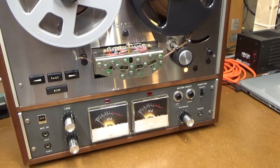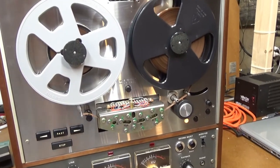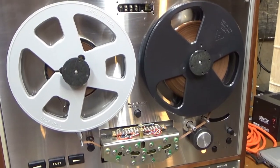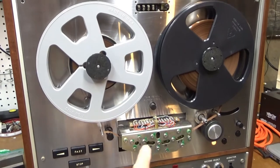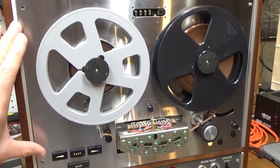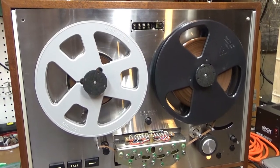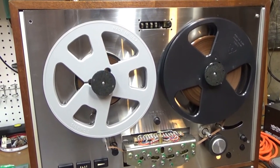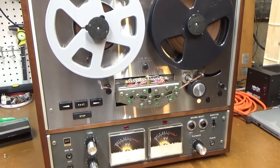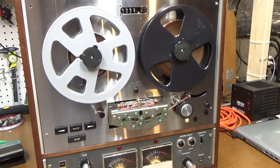Another issue is on playback — the audio off the tape was very, very quiet with a lot of noise in the output. That's improved with use. I think there's a little amplifier board in the tape portion that amplifies signals from the tape heads up to line level. The sound was low and noisy whether going through this amplifier or directly to a stereo amplifier. Now that's improved, but I think there are probably some bad capacitors on that amplifier — maybe even a weak transistor or two. I'll probably have to recap that board.